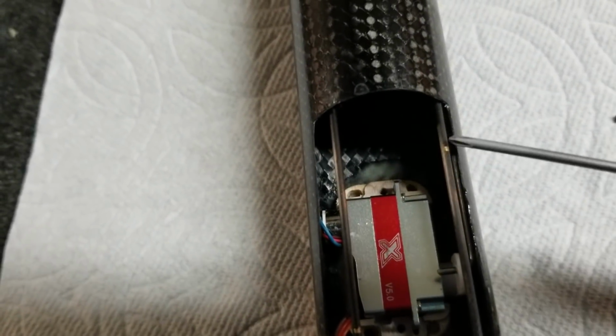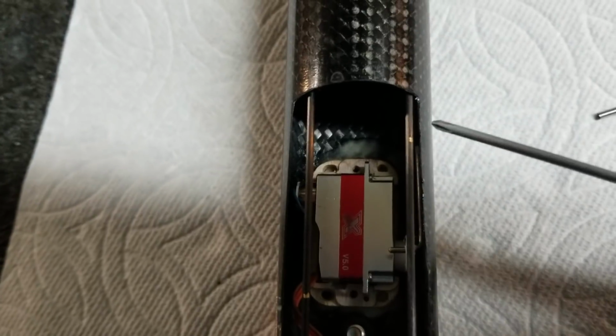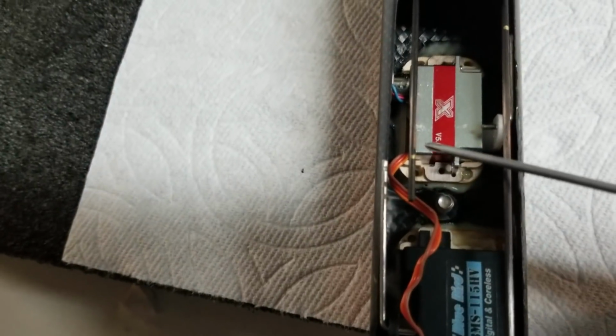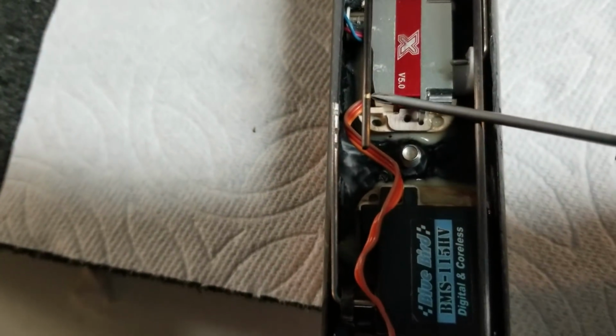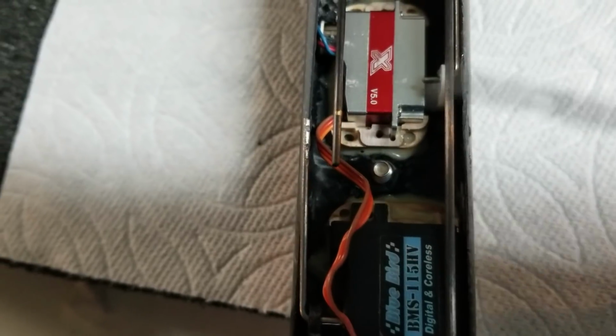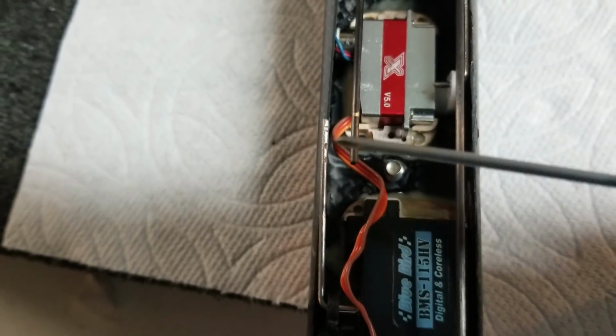With the tails taped in place, I've attached my L-bends and just marked where they end on the carbon rods, with this little gold marker. And then I'm just going to cut these off with a cutoff wheel and then do a little bit of sanding to smooth them out, and we're ready to attach these together.